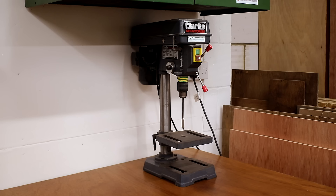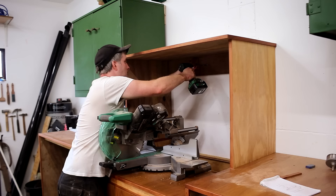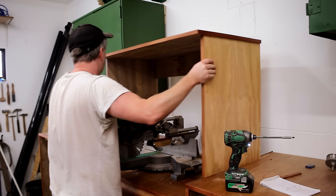That's because I want to make use of the space on top of the cabinet where I'm going to be storing a few more machines, and I want to be able to pull them forward and push them back easily. So instead I decided to route out a housing groove for my t-track to sit in — I needed to get the hood out of the way for this and can reinstall it later.